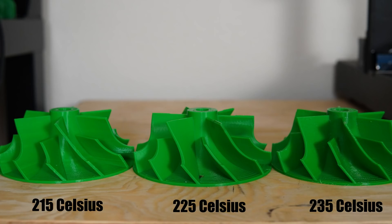The only real thing I've changed is bumping up my temperatures. For PLA on a standard 3D printer I'm printing at roughly 215°C. When I went to a 0.6 millimeter nozzle I bumped that up to 225°C, and when I went to a 0.8 nozzle I bumped it up to 230–235°C. The reason is that you're pushing more plastic, which is flowing out quicker, so increasing the temperature helps ensure the filament is flowing accordingly and that the plastic is truly molten, giving you proper layer adhesion from one layer to the next.